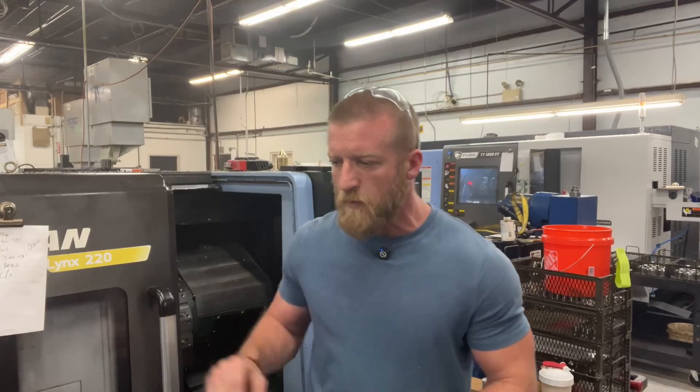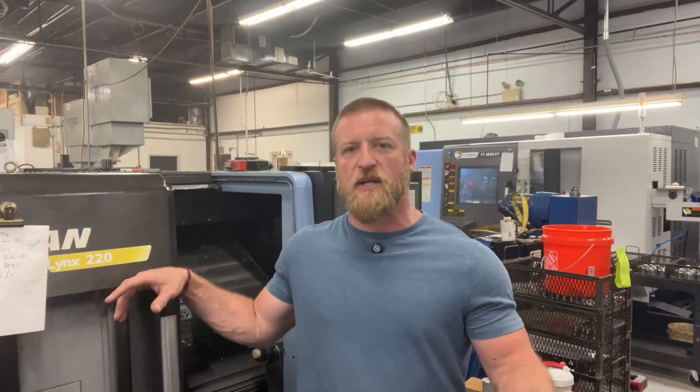Now I know I can really push those tools. In the first two sections of video before we did round three, I was pushing that 12-15 up to 1,200 surface feet, 1,300 surface feet. I was feeding anywhere from 5 thou up to 15 thou. Everything I gave it, there was no problem whatsoever. So I'm trying to get this insert to burn hot — basically trying to get it to fail. Everything I threw at it, it wouldn't fail. And it was a medium grade insert, nothing fancy, but it was fun. And I learned something.